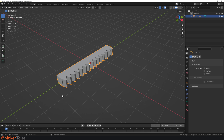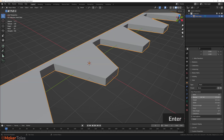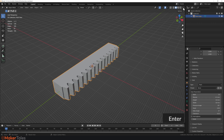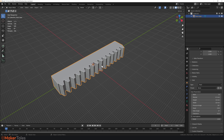No dialogue box came up when we created this because it's driven by its own object properties — this is as parametric as it gets within Blender, and you can change it on the fly. I'll go for a 1.5mm module — about the smallest you can go for 3D printing — a width of 10, and a height of 10. I'll also switch to cavity view. If you want to save a preset, just click here, name it 'Test 1,' and click OK.